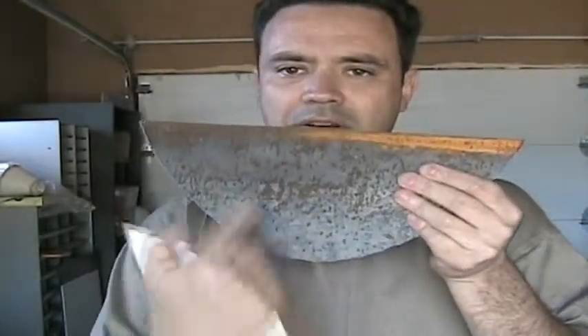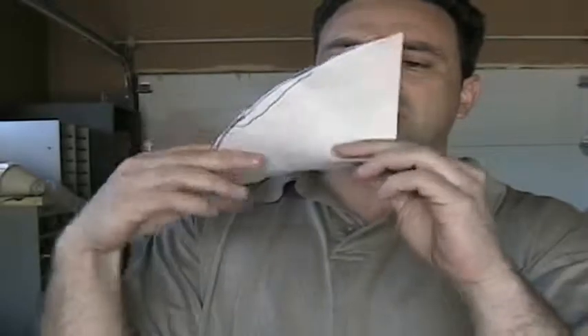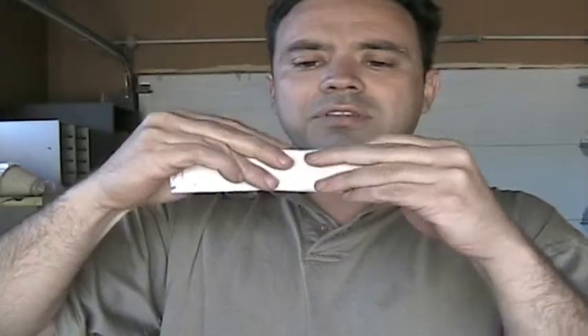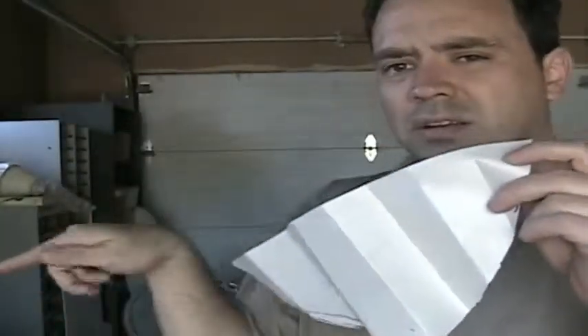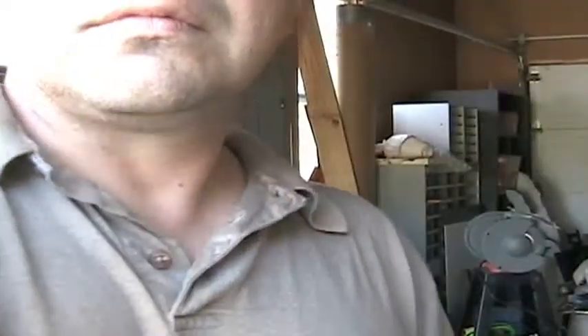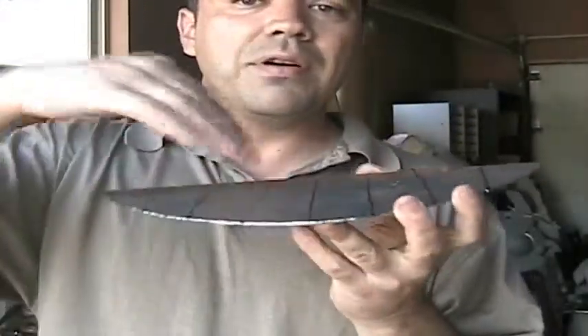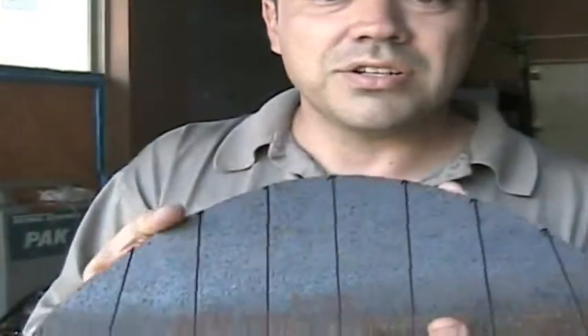What I want to do is mark some symmetrical lines down the middle of it. I'll get a little piece of paper and give it a couple of folds — it doesn't really matter where, as long as it's folded in half so the creases are in the same place when you open it. Each one of these creases I'm going to transfer as a line to the metal so I have a little grid for bending and keeping it symmetrical. I put some lines perfectly symmetrical on both sides, and then I'm going to hammer this piece of metal until it curves and fits like a face.